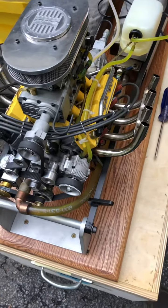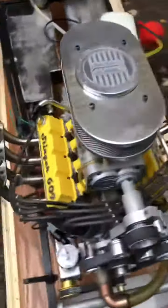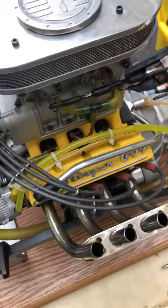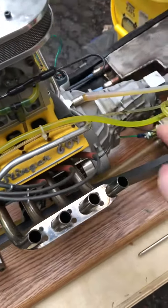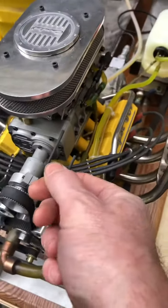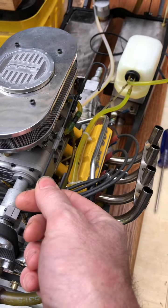If it's not firing easily, then there's something else amiss. Check the wires for the ignition system, make sure you have the fuel hooked up and that it's flowing correctly — you'll see the fuel start to draw as you crank. And of course, if you don't have the choke on and you're trying to crank it when it's cold, it's not going to run immediately.